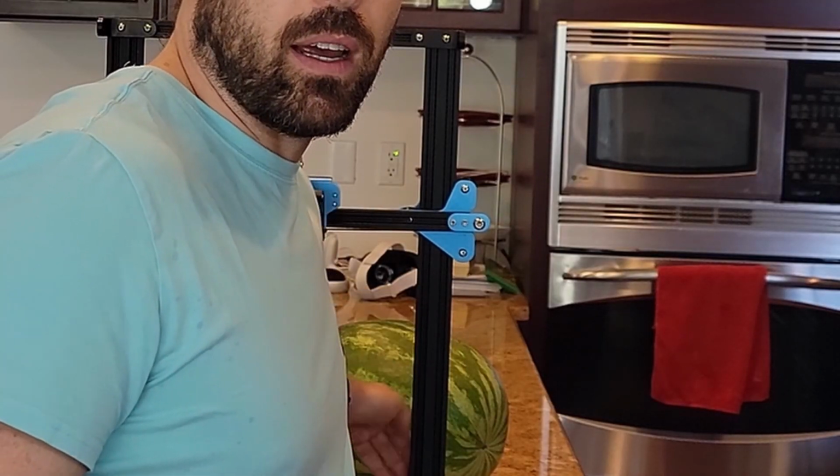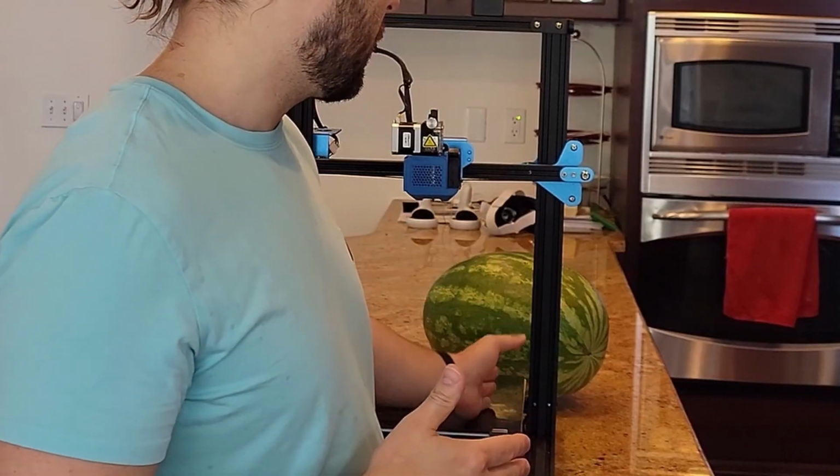I looked online, people suggested to completely re-level the entire thing, and I did that. I loosened up these blocks here, these screws. Who cares about the terminology, but yeah. So I loosened that stuff up and on the stepper motors, and I realigned it and I had it completely level. I didn't use a bubble level, I've done that before. And the reason you don't want to do that is because your table may not be completely level. I would take blocks and I would insert them on either side, equal blocks, and that would have an even distribution from the bed plate. I'd have the bed plate all the way tightened down so that'd be completely tight on all sides